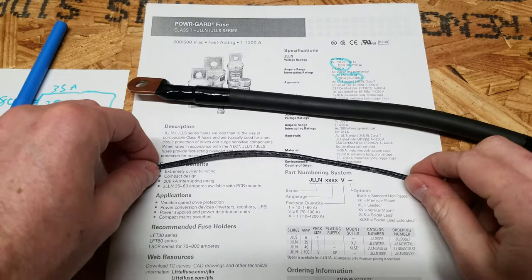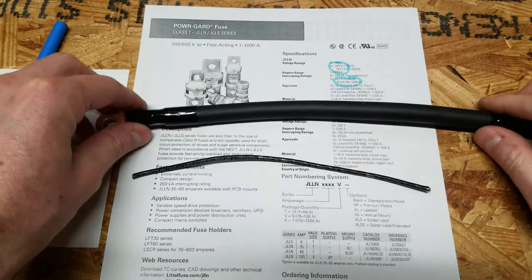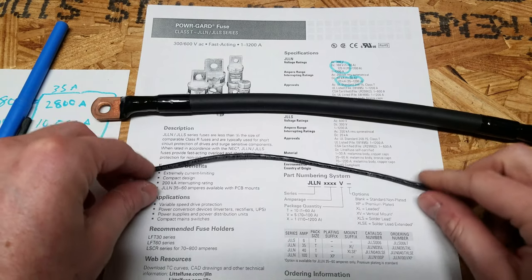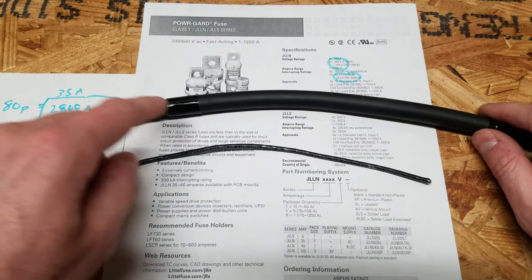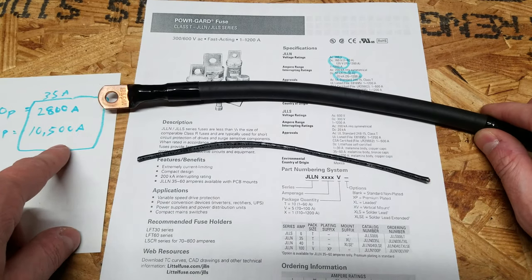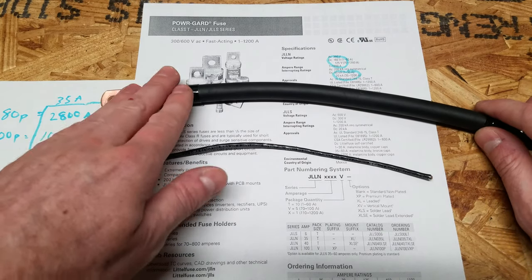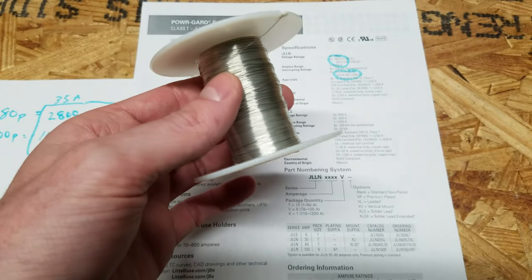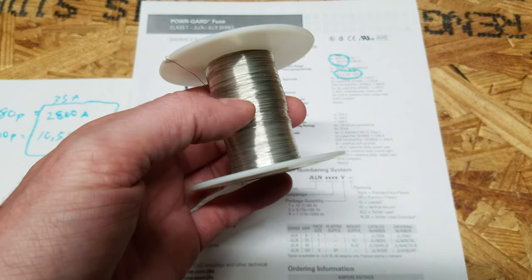Keep in mind we're talking about the main system fuse that goes before the main battery cables coming off your battery bank — not little skinny 14-gauge wires. A cable like this 1-aught cable can carry a substantial amount of current — 10,000, 20,000 amps — under a short circuit condition. Also, most people put thin fuse wire when they parallel their 18650 cells.